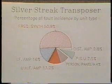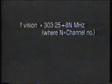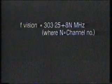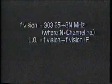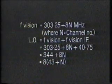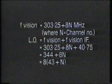Before we look at the way in which the oscillator works, we must decide on a suitable frequency for the vision carrier. The UHF vision carrier frequency is defined as 303.25 plus 8 times the channel number. If we decide to have the local oscillator on the high side of the signal, then the frequency of the local oscillator will be this frequency plus the frequency of the vision carrier at IF. For silver streak, this has been chosen as 40.75 MHz because it makes the local oscillator 344 plus 8N, where N is the channel number, and this is divisible by 8 to give the division ratio of the programmable dividers in the synthesizer.